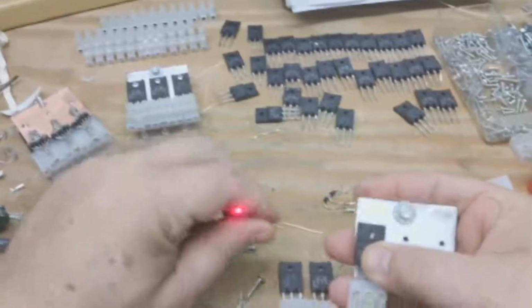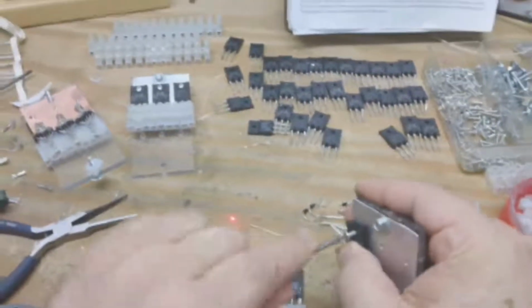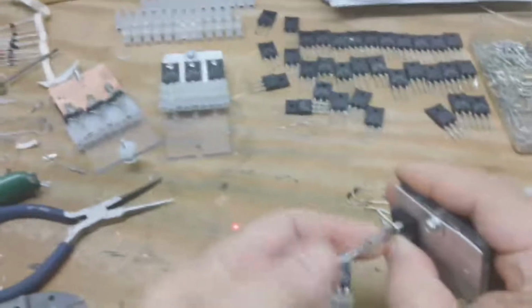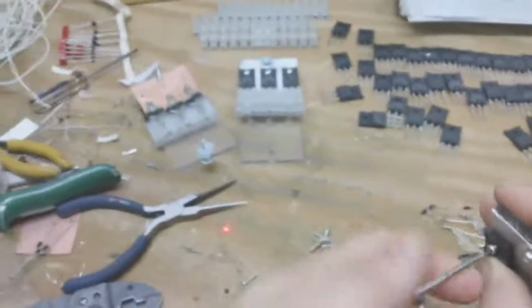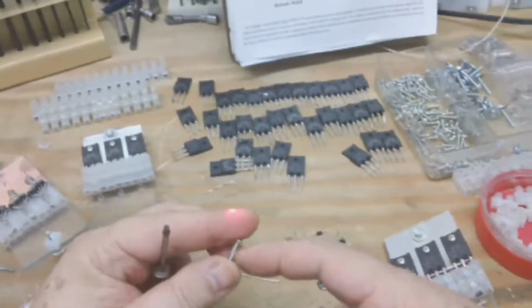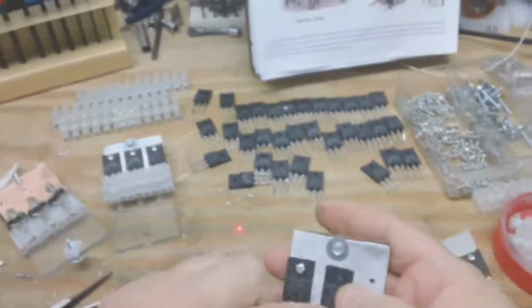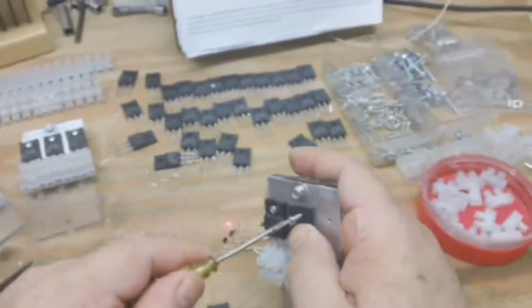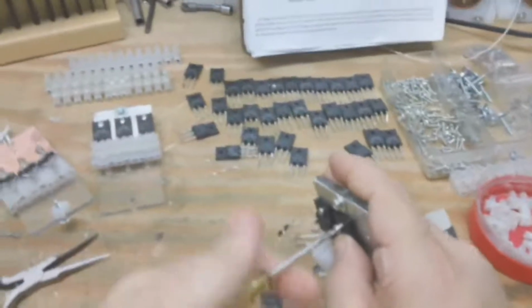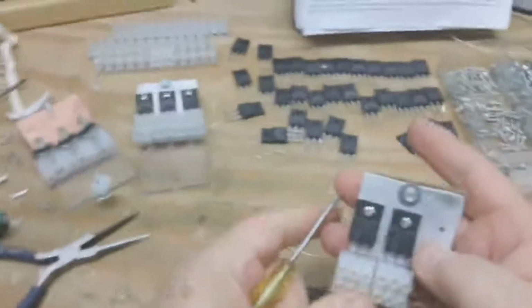What we're gonna do here is connect these to the circuit board, the control board. It's not really a circuit board. And all I can say here is that if you use micrometers, or actually digital calipers, putting these little screws and stuff in makes it a lot easier because you can use the calipers to get the dimension in between these threads and use it to find the right drill bit for the right size for this to work perfectly. And I'll see if I can get a number for the drill bit and the screw and put it on the PDF for you, because it makes it a lot easier when this stuff goes together like that.